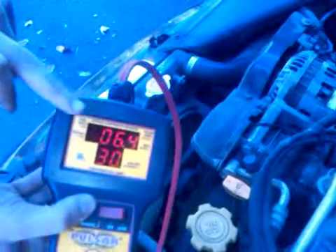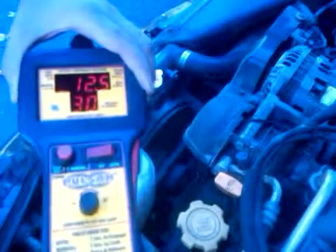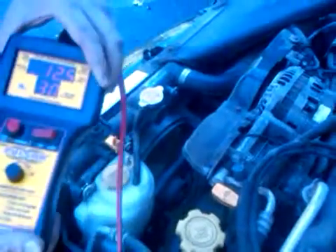If I really let the fan sit for a while, letting the fan's inertia slow down so it comes to a stop, then power it up again — you can see it draws 16 amps in the beginning. If that was drawing maybe 30 or 40 amps in the beginning, that's going to give me a good indication that I have a motor that's starting to go bad. So this is another edition of one of the many functions of the Pulsar.